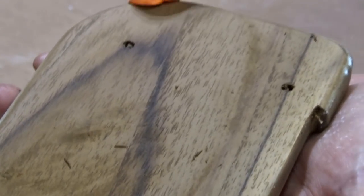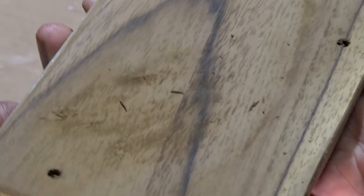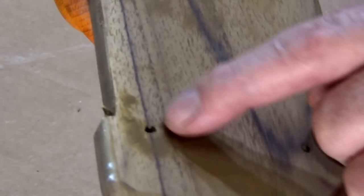But you've got to work through that stage. Keep going. It looks like you've ruined it, but you haven't. You just keep going. Keep grinding that stuff in there until it sort of wipes off the surface completely, and then you'll find that you've got completely filled grain. You can see it fairly clearly there. Now you can just let that dry and then sand that off lightly and then start again, but I usually just keep going. It'll eventually just sort of get absorbed by the linen cloth or wiped off the sides.